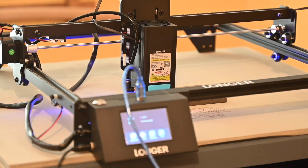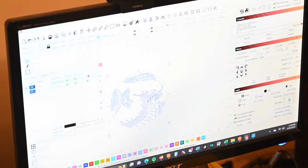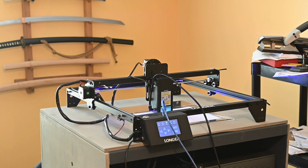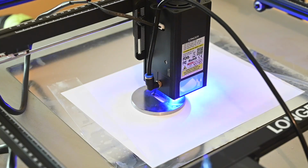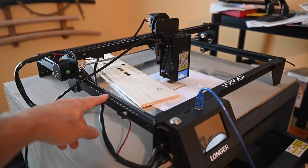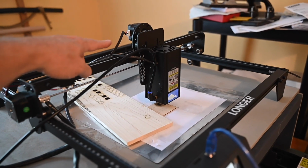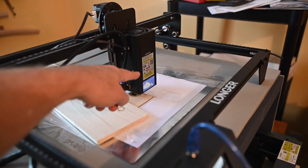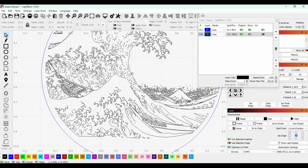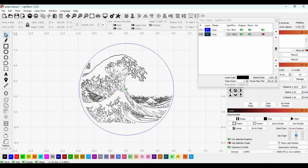Basically, laser engravers work like 3D printers, CNC machines, etc. Your computer sends an image to the engraver, and depending on how you set it up, how fast the head moves, and how powerful you set the laser, it'll engrave or cut the material you're working with. You have a rail system, a couple of stepper motors, a controller, and a gantry that transports the laser head. That's about it. The other thing you need in order to make them work is a computer and some software. I use software called Lightburn, which is pretty much the standard for driving laser engravers.